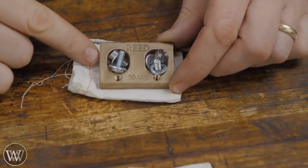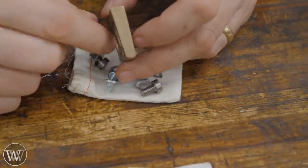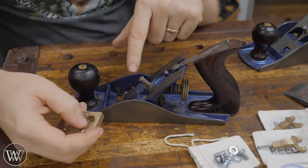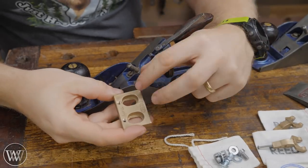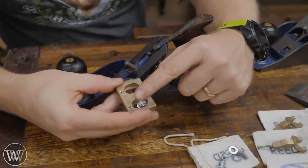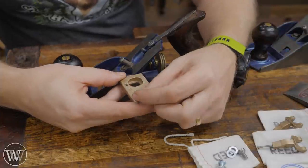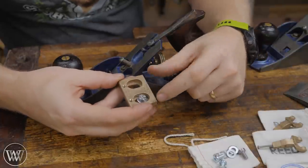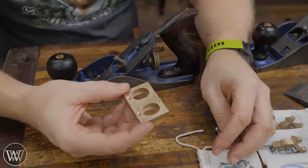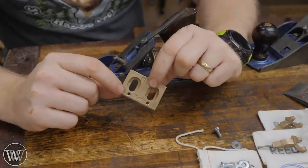Then we have the 55-degree wedge. The problem with this is it's a bit thick — a decent amount of material — so the screws won't reach all the way through, and the alignment for the screws would be in the wrong place. So with this, you actually take the frog out, put two screws down through this and lock it into the bed, so this becomes the new bed that the frog will sit on. Then you run screws down to attach the frog to this plate, giving you the adjustability to put a little bit higher angle — up to 55 degrees, which is a really high angle plane. So if you're having a lot of problems with tear-out, this might be the answer for you.